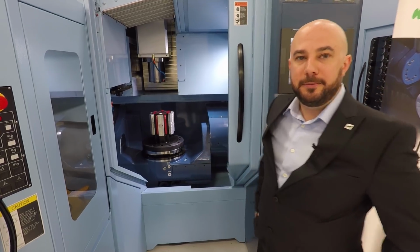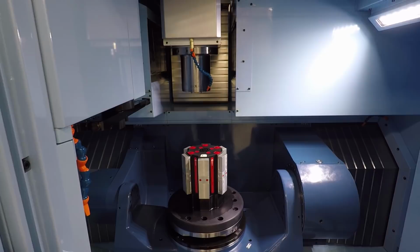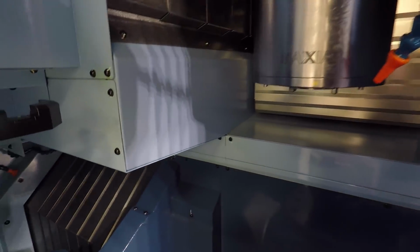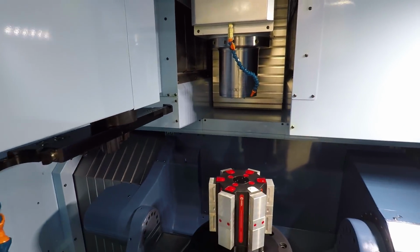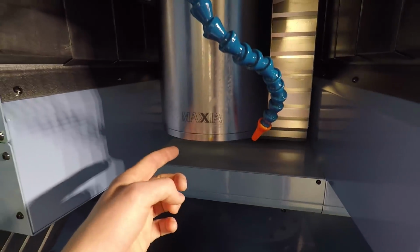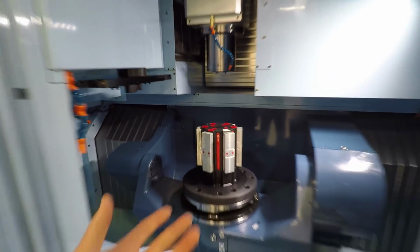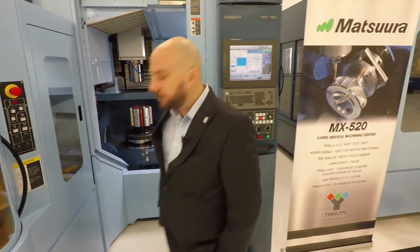Yeah. So it's not only the workpiece, but for us, it's doing setups, checking something. We have a mirror that we use to get behind it, but here I can almost look behind that myself. But also loading tools. It's actually pretty difficult for us to load heavy tools, a little bit of a strain. And here, literally, my elbow is still touching my body, and you're at the spindle. It's just nice. And that moves in, you can pull the spindle actually out toward you even more. Oh, yeah. Right.